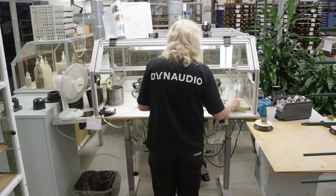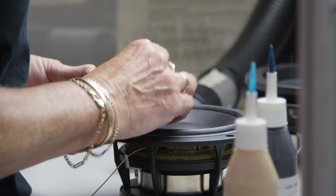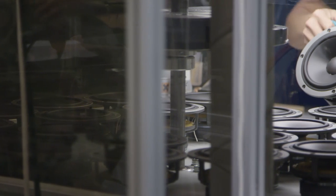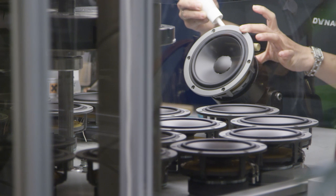It's very important to align your voice coil and your air gap. By using a damper or spider we control the position of the voice coil in the air gap, and the symmetry that you get from the spider and your surround has to be optimized — which you can do by simulation and by measuring. If you look at a Dynaudio cone it's not as deep as competitors' cones because we care for the dispersion and the off-axis characteristics.